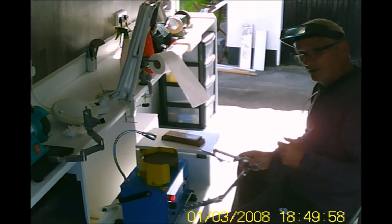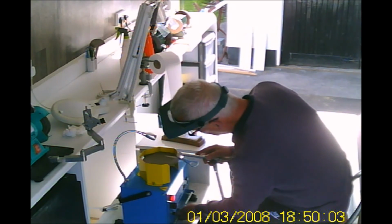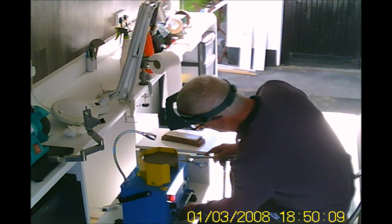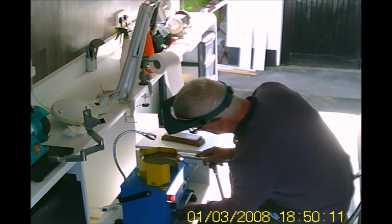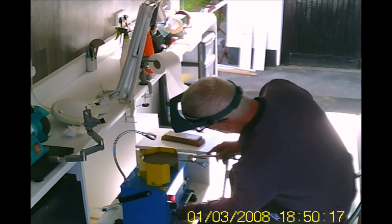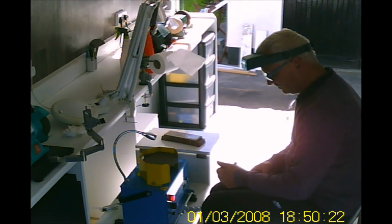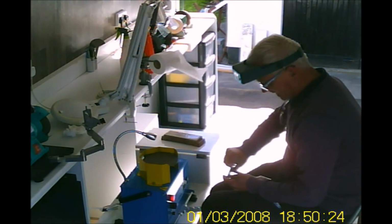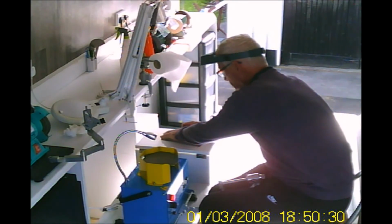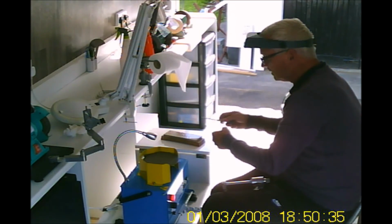At the moment there's a 2000 grit paper on there, so we would assume that everything is set at that angle, and we will sharpen. And again we would go again and sharpen. And once we were happy with the sharpening process and we raise a nice burr, we would then remove and come to the whetstones, where we would then take away the burr and go back on.